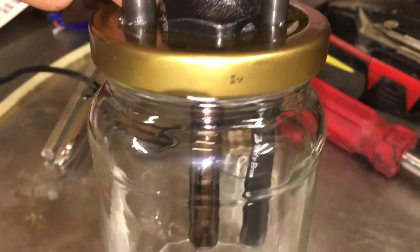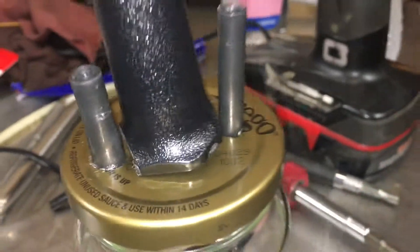This body right here is just a pen body — it goes down in there because you want to keep it away from the heating element and the side of the jar. I'm going to epoxy all this down, mix up a batch and get this glued on here. The top is not critical, but all this down here is going to be epoxy. I might throw some silicone around here too — some RTV or gasket sealant. Everything is epoxied up already, you can see right here.